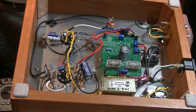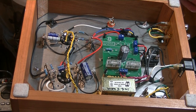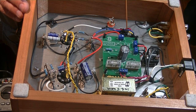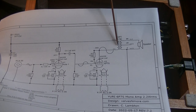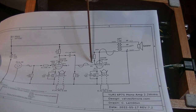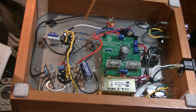I came over and had a good listen to them. Immediately, to me, they sounded a little bit muddy. The bass wasn't as well defined; the music wasn't quite popping. So I recommended that we remove the ultralinear tap and bring them over into pure class A quasi-triode mode. I'll show you what we have to do. There's a 40% tap here — a 40% tap comes off the primary side of the output transformer at 40% of the turn ratio — and it connects up to the screen grid, which is grid 2.